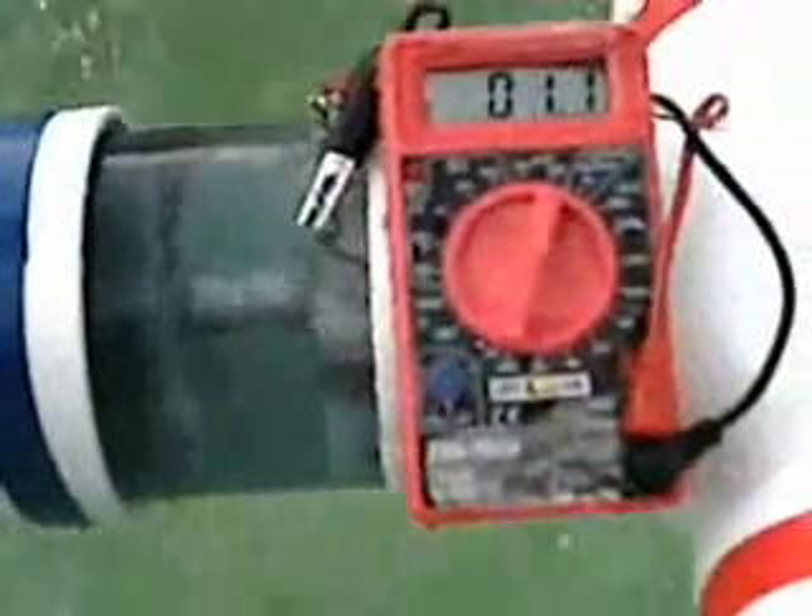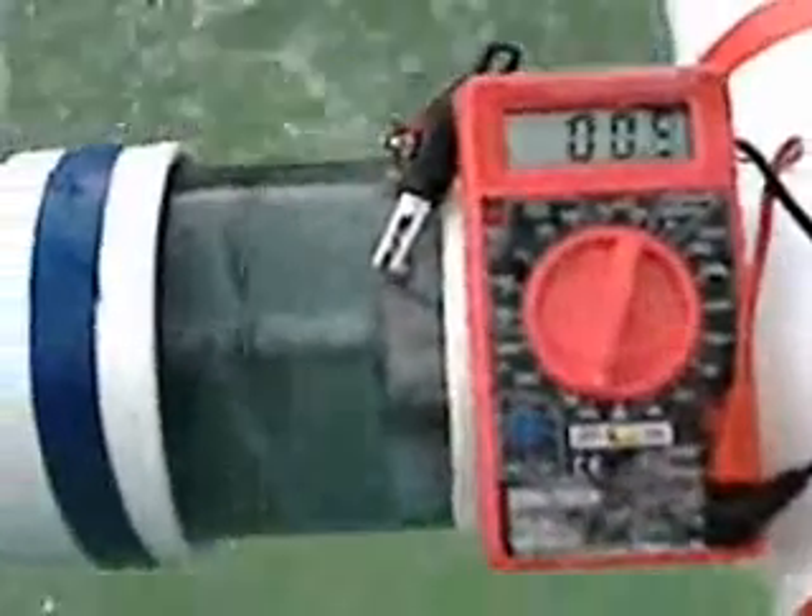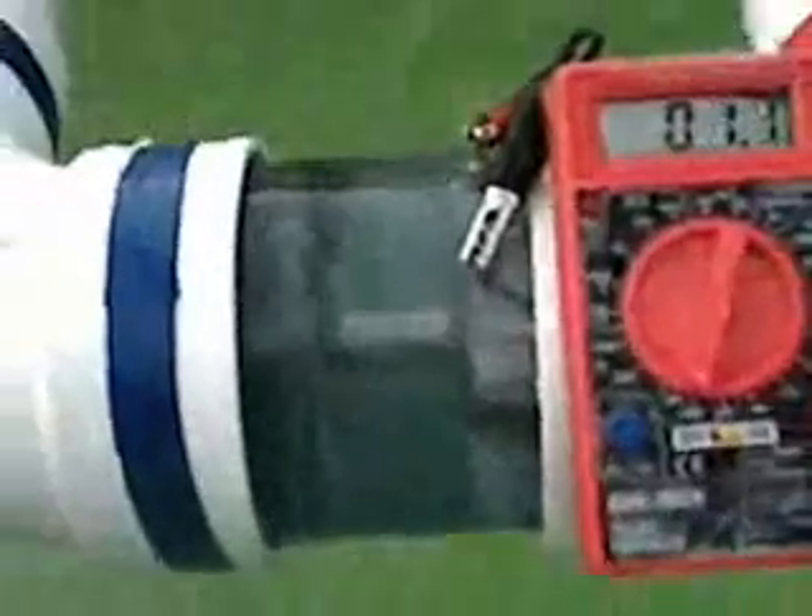This unit is sitting right up to the bottom of the tube — it's sitting on the bottom and is much larger. The alternator is supposed to run at about 2,000 RPM, but it's actually running at about 200 RPM here because our waves aren't big enough.